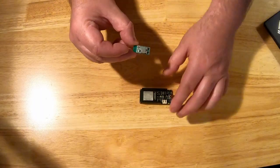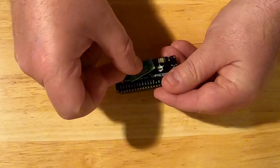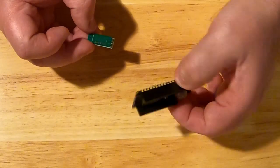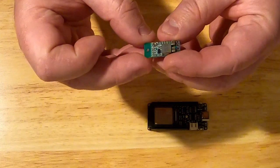We also need a power supply to drop from 12 volts — the boat voltage — down to the 5 volts this requires. Previously I'd used some I had lying around, but now I've run out of those, so I bought these other ones to try. They're a little bit different. This component is pretty small — it's going to sit underneath the bottom of the FireBeetle and hide under there. I'll attach it to the bottom, and eventually I'll get a friend to 3D print a case for it.